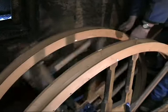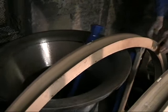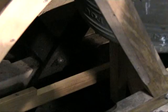The stays have quite deliberately been made too long, and Graham is bouncing the stay against the slider to put a little mark on it, and then he can see where to cut it to make it the final correct length. He's now going to turn the bell over once more so that you can see how the stay leans against the slider and how the slider is restrained within the groove on the slider board.